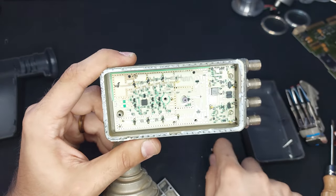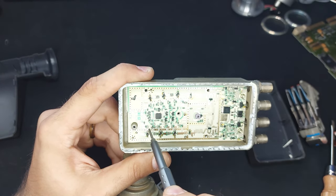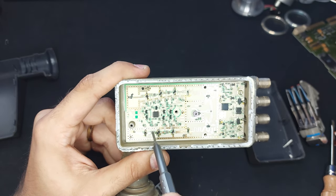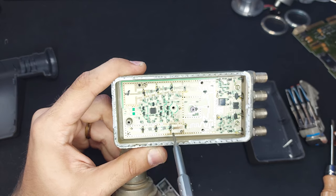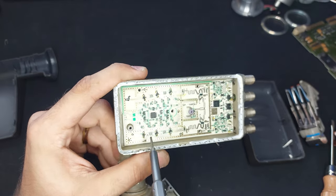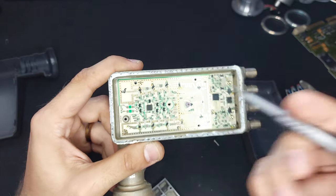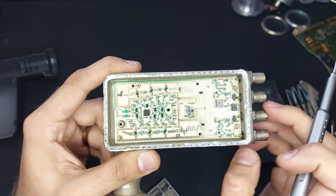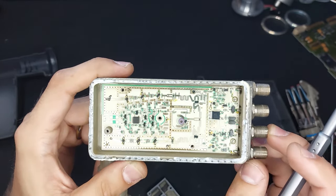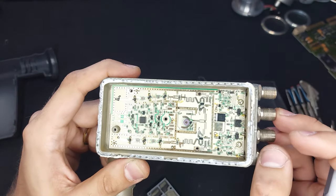These, I'm pretty sure they're amplifiers. All these stages here. This is the biasing for the amplifiers, probably resistors and capacitors. And this is to couple just the AC, so you can see there's capacitors running along here. Because you don't want the DC from the previous stage to get in your AC path, basically. So yeah, some electrolytics or tantalum capacitors here.